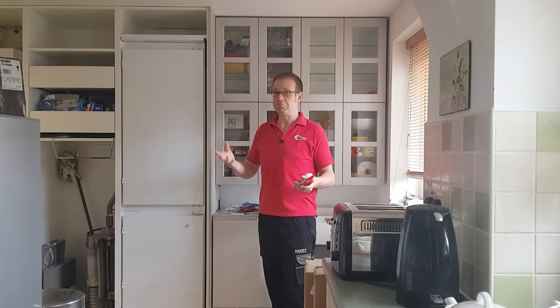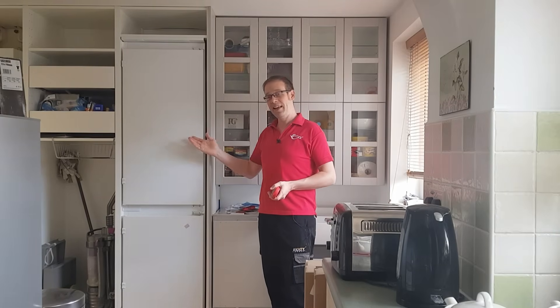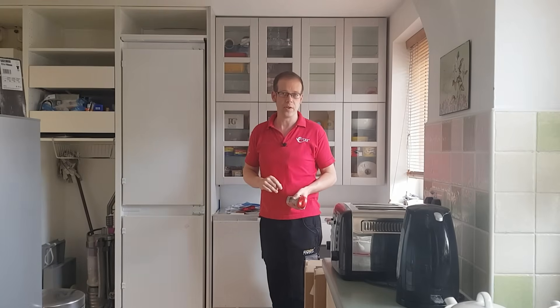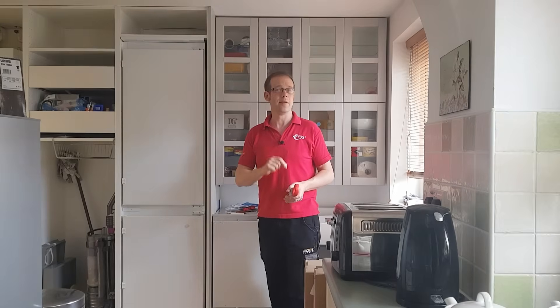And it needn't be a PC or a laptop either. Everyday items like TVs, modern washing machines, dishwashers, even fridge freezers may leak a little bit of current to earth as part of their normal operation. It's not a sign of a poor quality or faulty appliance — they're designed to work this way.